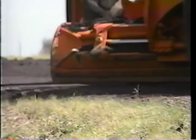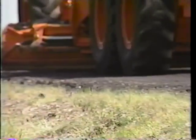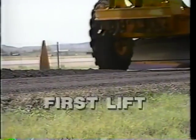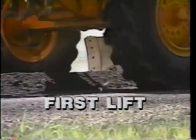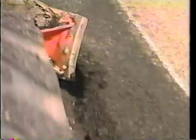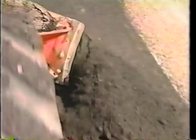The toe of the blade must be set correctly. If it is too loose, a ridge will be formed where the blade picks up the windrow. Quality is a prime consideration because this will be a permanent repair. The toe of the blade is positioned slightly past the outside front wheel at a sharp angle. The moldboard is pitched slightly forward and raised just enough to allow material to flow underneath. Pre-mix coming out past the blade should not fall under the rear wheels — the material must be carried just beyond the patch.